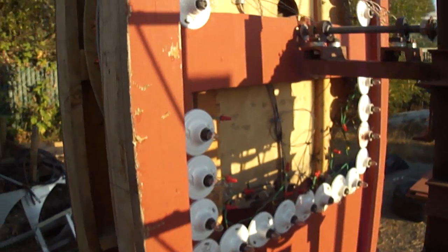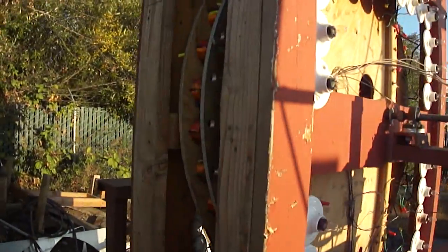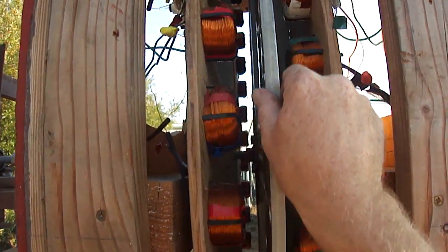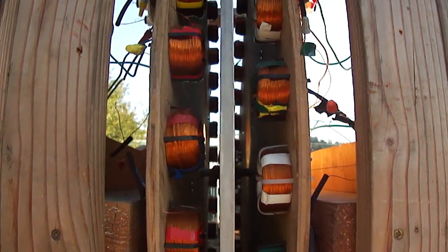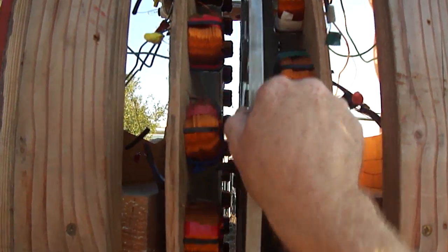These are the light banks attached to the actual generator. The generator is this box, and inside the box you have a number of copper coils and a wheel. When you watch the generator run you'll notice that it doesn't run steady. As you can see, the wheel is way out of plumb. Should have had that straightened but a little late now, and this is going to cause the lights to fluctuate on operation — and that is the cause.